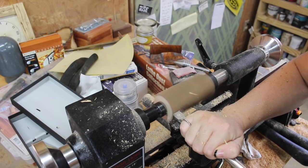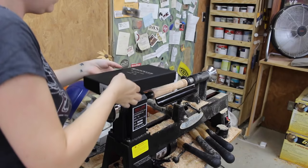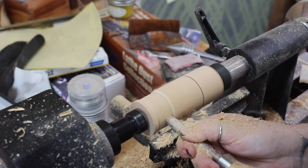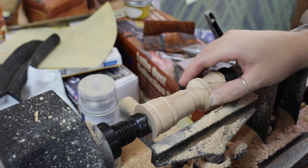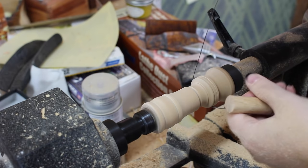On my first few shakers, some of the larger carbide tools weren't allowing me to get the detail I was aiming for. So instead I switched to the pin turning set of carbide tools that Rockler sells, and these tools definitely did the trick. They're meant for pin turning — smaller, more delicate items — so for smaller spindle work like this, they were perfect.